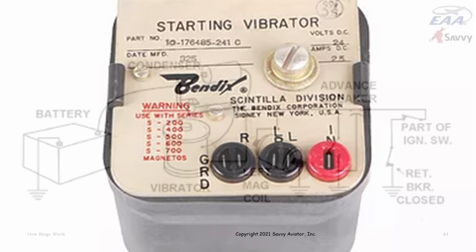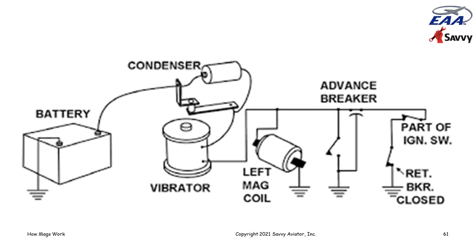Here's a simplified diagram of what that looks like. It uses voltage from the ship's battery, goes through the doorbell buzzer — which has a condenser in it to prevent arcing inside the buzzer — and then the voltage from the buzzer, which is a train of pulses, gets sent to the left mag coil when the retard breaker is open, and generates that spark. The start switch is a fairly fancy switch with lots of wiring because it does a whole bunch of things: it has to ground out the right mag, connect the retard points from the left mag to the buzzer, ground out the regular points on the left mag, and crank the starter. So it's a four-pole switch that does all of those things.